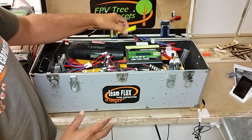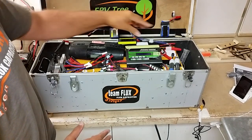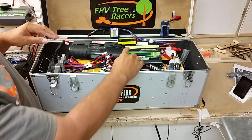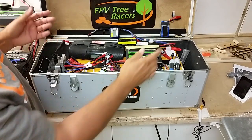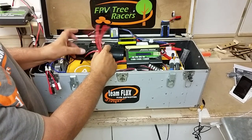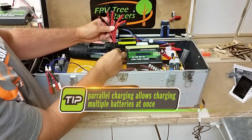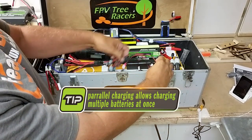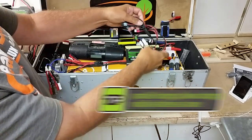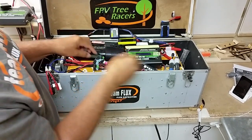There's a battery voltmeter that sticks right onto the top of the charger, and I always have a pen and marking device on the charger too. Sometimes I throw yellow tape across to count how many charges I've done. I'm a big believer in parallel charging, so on top I use power poles as my connector and can charge up to six at a time, with splitters and lots of squids coming off. It can look like a bit of spaghetti, but it works really well.